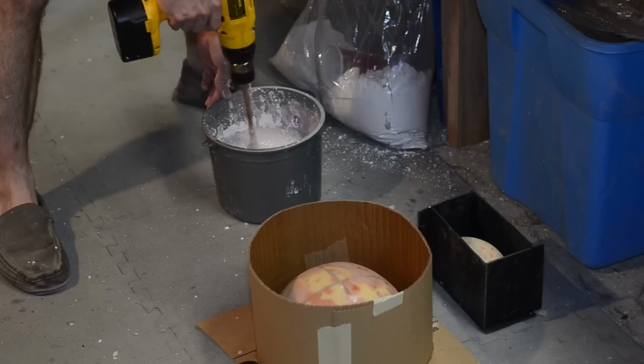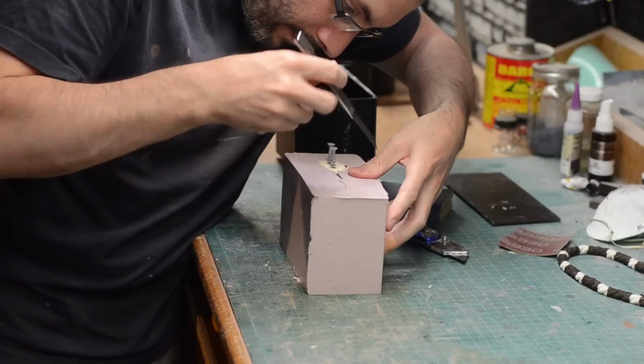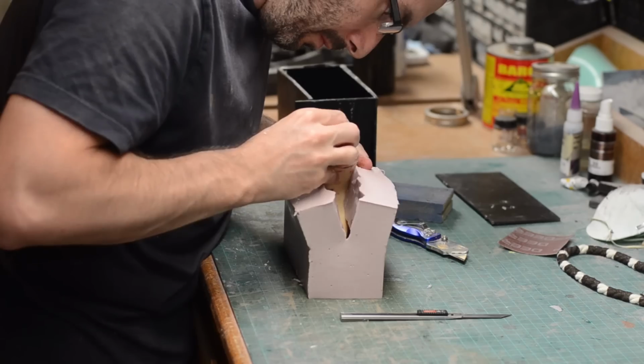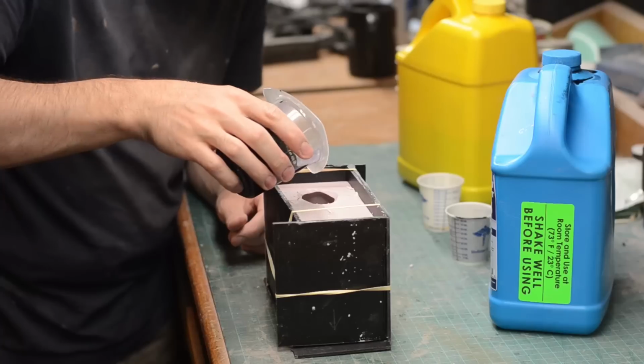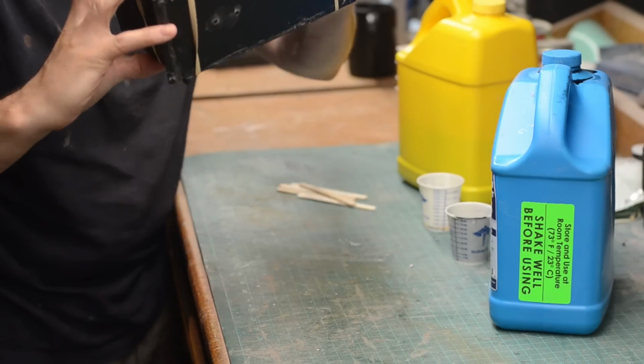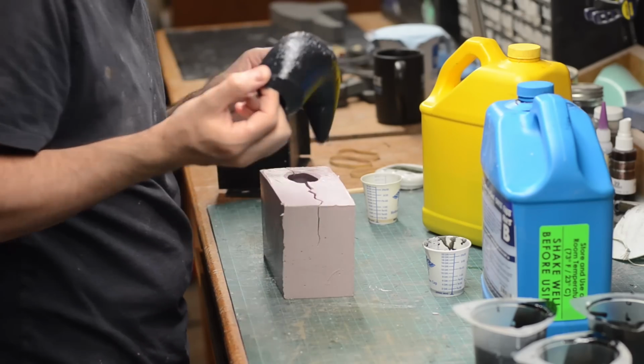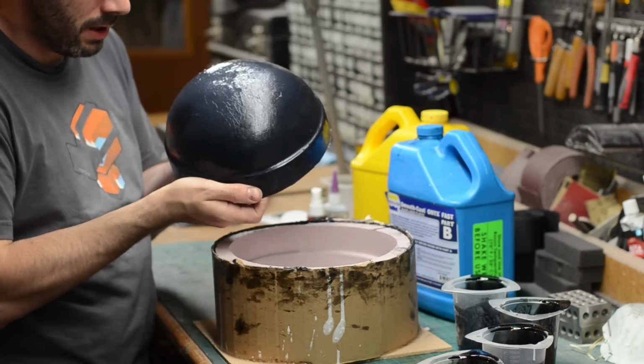Anyway, I had my shapes done, and I poured a whole bunch of Alginate on top of them to make the molds. Then, once the Alginate was dry, I could liberate the pieces from the mold and get to casting. For these, again, I used urethane resin and various formulas to slush cast a thin layer of plastic on the inside of those molds. Then, once those cured, they could be pulled out of the molds and finished up. Again, lots of finishing. All that priming and sanding and filling and Bondo I did earlier, I had to do it all again. But I did do that all again until the pieces looked really great.